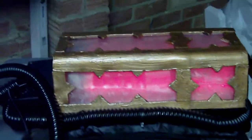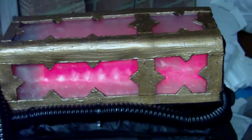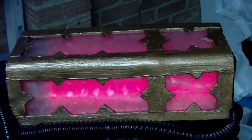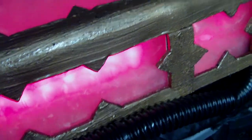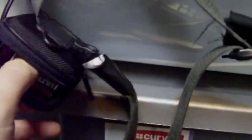What we've actually got — the main part here — contains a couple of banks of LEDs. At the moment it's got two banks of 10 red ultra-bright LEDs, and they're being controlled by pulse width modulation by an Arduino, which is currently living in — you can just about see this box here. The whole thing's powered by just a lithium PP3 9-volt battery down there.